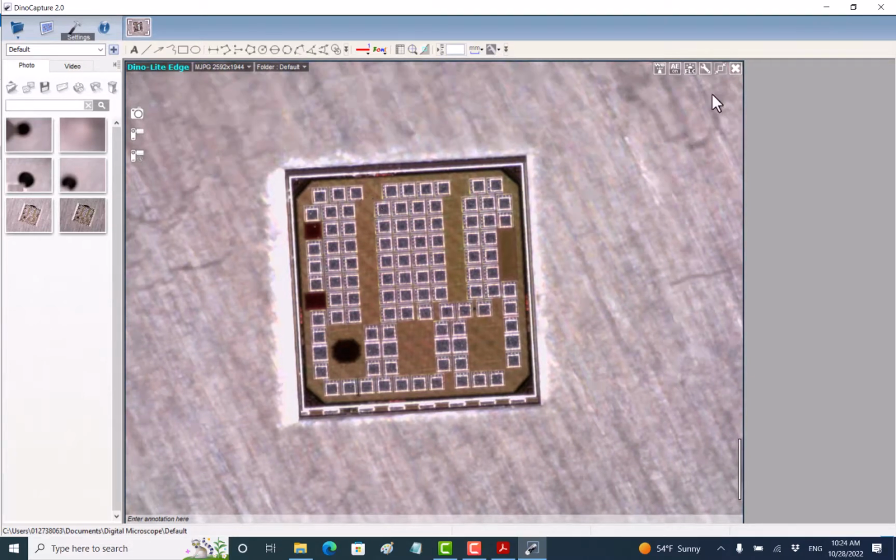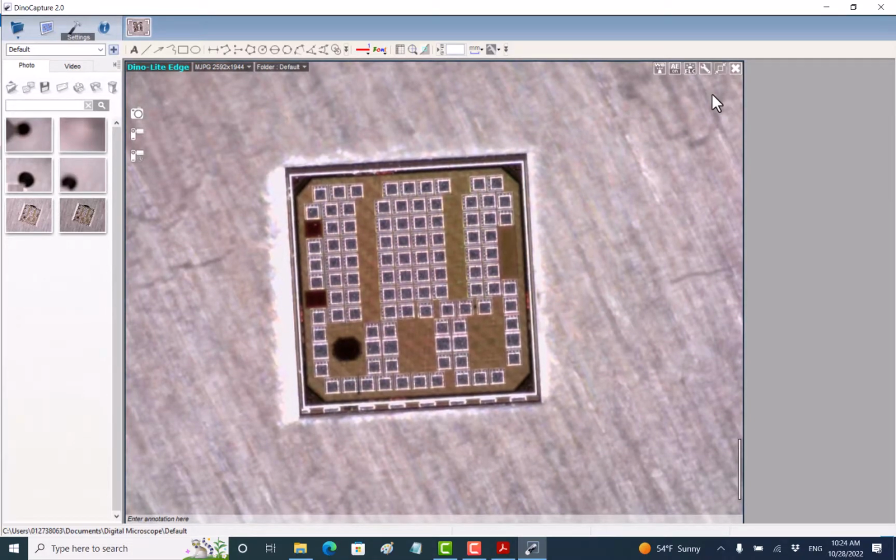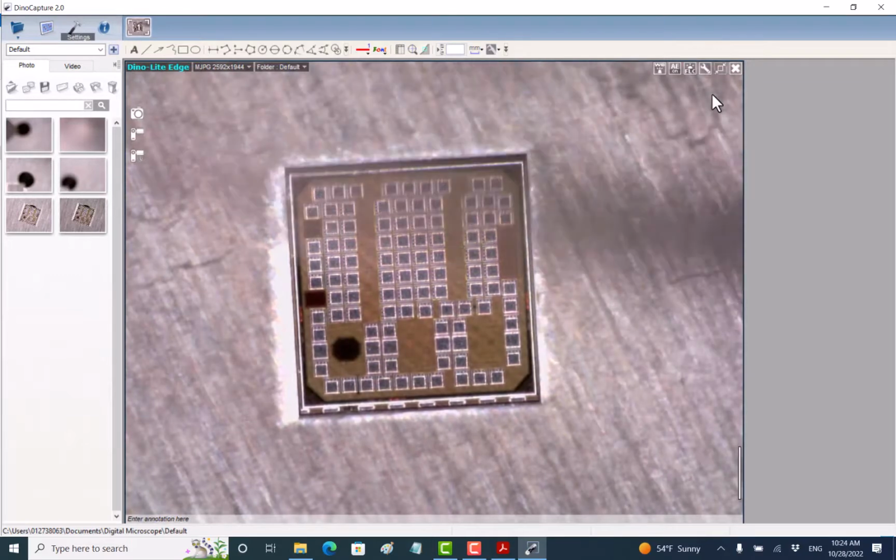This one you really need skill, right? When I do the probe station, I broke many probe tips. It's very normal. You will do something very stupid. For example, I did not lift the probe tip and started moving the stage, and then they will scratch. You also damage your chip. I broke many, so that is what is expected. So I try to move gradually and then I feel it.